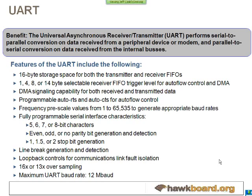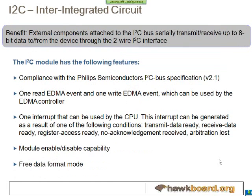We also have UART. There are three UARTs on this chip, and they go up to 12 megabaud with a lot of customizability — whether it's the number of bit characters or the number of oversampling you're doing. We have three on board, but with the PRU you can get up to either four or eight additional UARTs, depending on whether they're going to be full duplex or stripped-down versions.